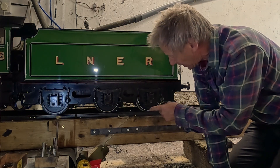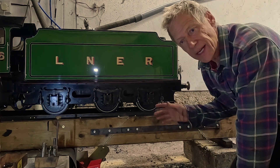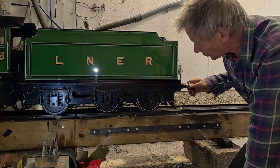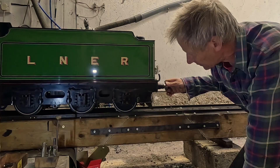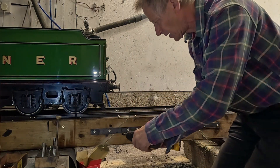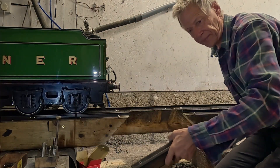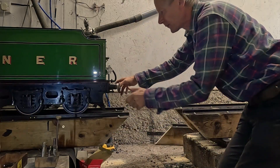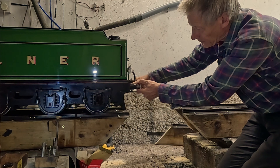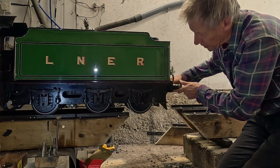I've made a flat on the wheels as well, so I've got to drop these axle boxes with this wheel set out. To make it easier to drop wheel sets from the engine, I've made this little wheel drop here, and all I had to do is move the engine to there and then remove these two little sections. Now I can just wheel the engine gently back over here and it won't tip, because all the rest of the weight of the engine is holding the tender.